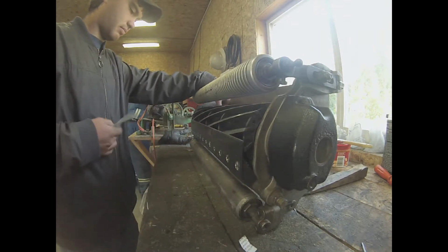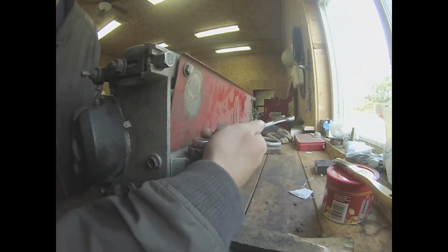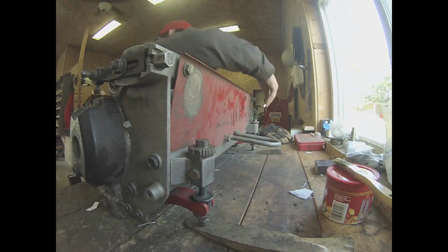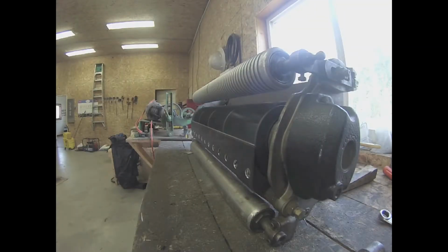It seems not to be too bad with the reel. It seems to be cutting paper somewhat. What I am going to do is adjust the bed knife by tightening it about 2 clicks, and backlap it for about 2 more minutes to get it sharp enough to cut paper.